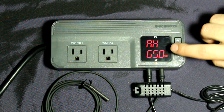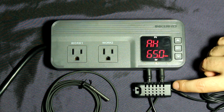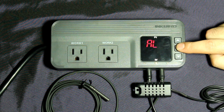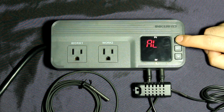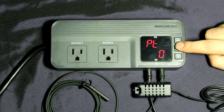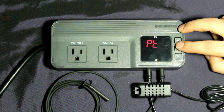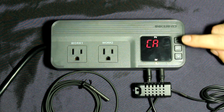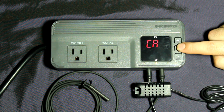The alarm high is set to 65% relative humidity — if it goes higher than that the unit will beep. That's really important; if I had this in my tent a couple of weeks ago, that incident wouldn't have been an issue. The alarm low is set to 8% humidity, which I don't think it'll ever reach. There's also a compressor delay option here, but since my humidifier can turn on and off without issues I'll leave it at zero. The calibration setting is available here too, but since this sensor is very sensitive and matches my other sensor in the tent, it's reading correctly.